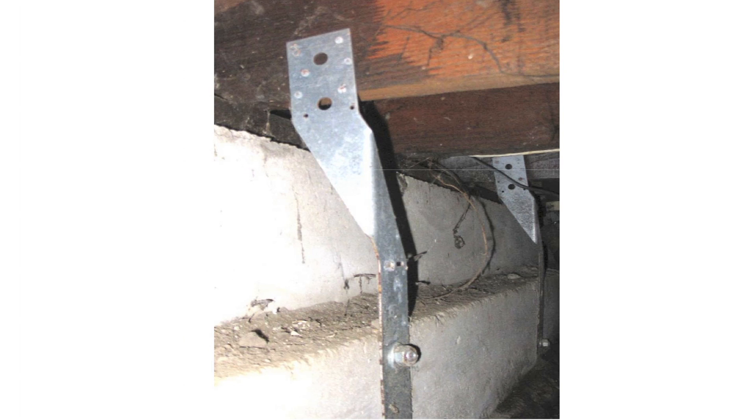This is a Simpson FJA and, like the angle iron, the bottom of it is bolted into the foundation and at the top it's attached to the joist with nails. A Simpson FJA has the strength of approximately one eighth of a foundation bolt. This house was retrofitted with FJAs with a building permit. The permit was signed off by the building department, and the homeowner probably paid four to six thousand dollars to have hardware installed that does not resist earthquakes. That is why it is so important to make sure the hardware your contractor is installing can resist the amount of earthquake force you need it to resist. The building department will not do that for you.